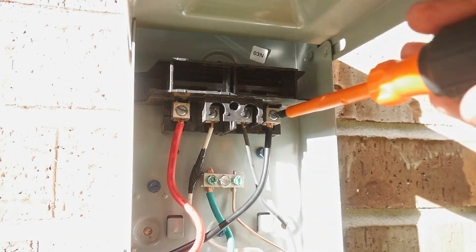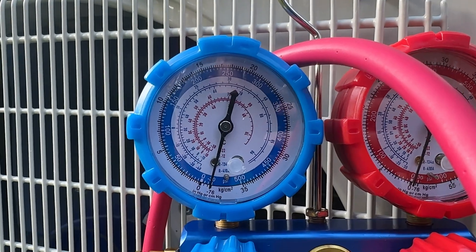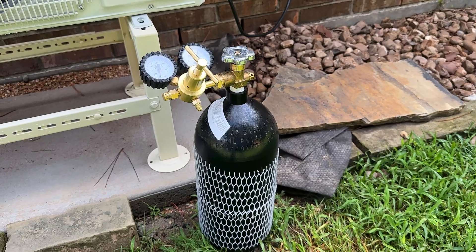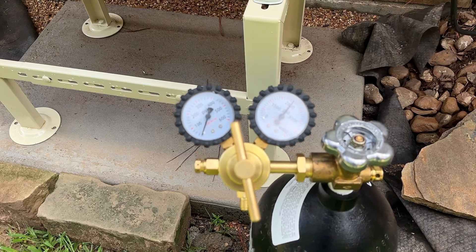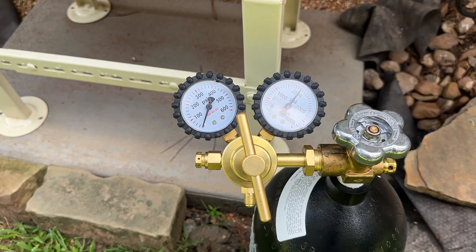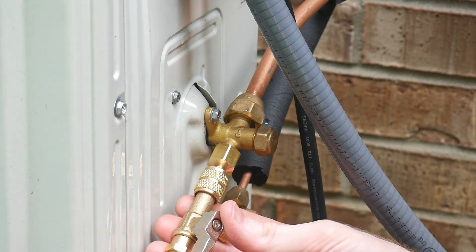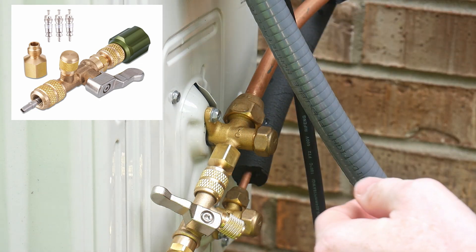I checked on the line set — still holding strong after an hour, so I'll call that good. I rented a 40-pound charged nitrogen bottle for about $45 from my local welding supply shop and ordered some budget gauges from Amazon. After this pressure test, I'll store the gauge set with my vacuum pump for the next mini-split install. I used a tool to remove the Schrader valve to avoid any flow restrictions during the test. I then hooked the nitrogen bottle to the center yellow line of my gauge set and the low-pressure blue line to my mini-split. Be very careful — you have the ability to blow out your line set with 2,000 psi of charged nitrogen, which would wreck the unit and potentially be very dangerous.